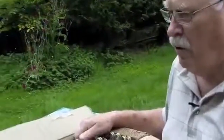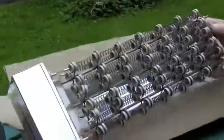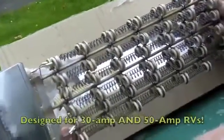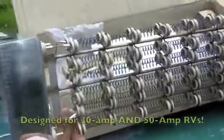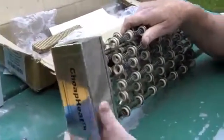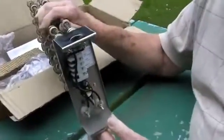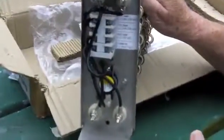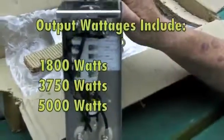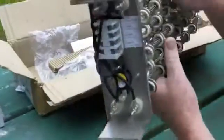The next thing we need to discuss is the heater coil. This is the heater coil we're talking about. You've got one heater coil that operates at three different heater settings and two different voltages — it's all one unit. This is a patented coil and we are the only ones that have it. It makes it very easy for the technician to hook up: all the technician has to do is slide in a wire, twist the screw, pick which heat range you want, slide in the other wire, twist the screw, put the cover back on, put two screws in it, and he's done.